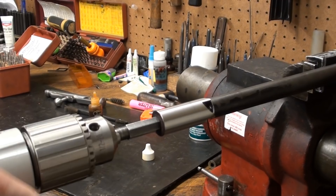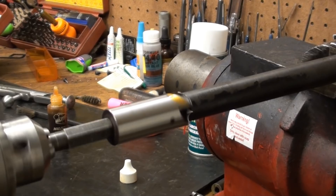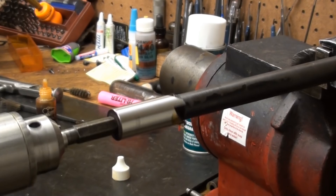The mandrel should be a firm fit — it shouldn't have any play. There are plenty of different sizes in the set, so you shouldn't have any trouble finding the one that's best for it. Go slow. Use lots of oil.